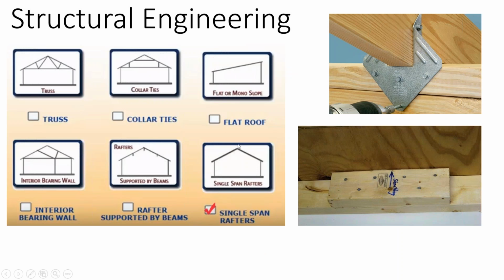You want to have the truss of the roof that you're anchoring the array to anchored to your building wall. So putting hurricane clips between the truss and the building wall is a good idea. If you're concerned about lag screwing into the rafter, you can sister or daughter blocks of wood next to the rafter.